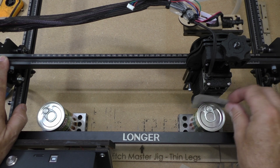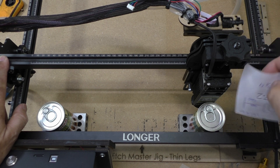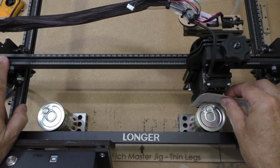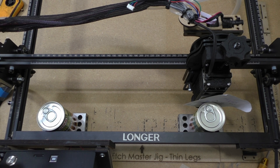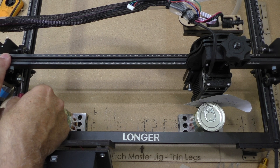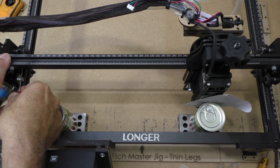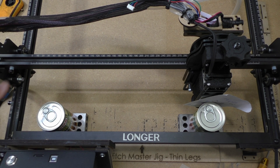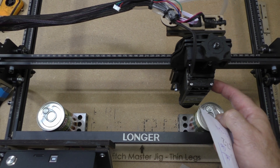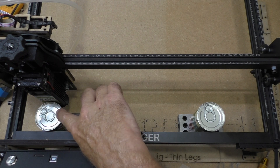Hold the left-hand side of the gantry and slowly move the laser to the other can of soup. If you see it hitting the tins, just gently press that up because we've undone that coupling. Tap the gantry towards me - too loose. Now that feels about right, so without moving the gantry, keep a little bit of pressure with a finger and do the right-hand side allen bolt up. Check the tension on the paper and gently push the laser - do it slowly so you don't back-voltage anything. I'm going to have to do my test again because my tin moved.